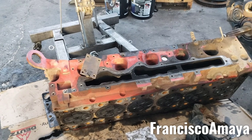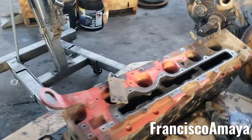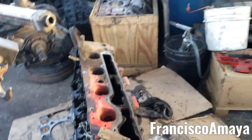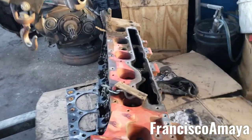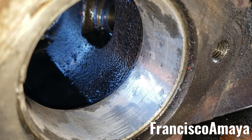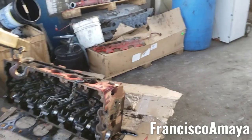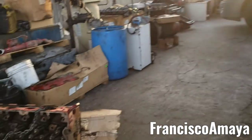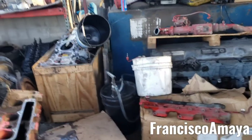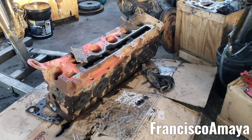We already have a used cylinder head that was rebuilt by a third-party vendor, which is going to be cheaper than buying from the dealer. That is going to cost around twenty-five hundred dollars — still big money, but not like five thousand dollars from the dealer. We can also see that the bearings are getting wet, which is going to cause problems with low oil pressure on this Cummins ISX — that happens mostly because of that issue.